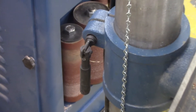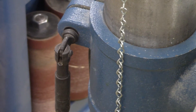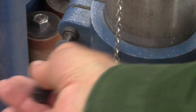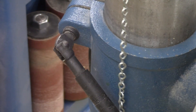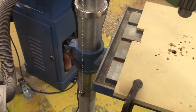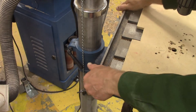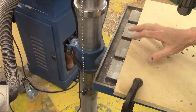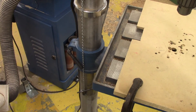On the opposite side of the table, opposite from the height adjustment hand crank, is the table locking lever. I turn this little lever until I lock that table in the right position. With that locking lever locked, I cannot get the table to move left or right, and I also can't get the table to lower or raise up and down. So the table is now locked, and I'm much more likely to get a very precise hole drilled exactly where I want it.